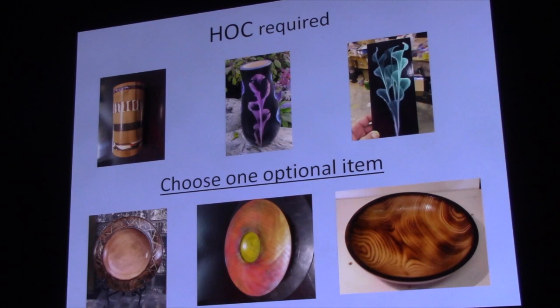And then I thought, well, the first one I did makes way too much, and that stuff's not cheap. It's expensive. So I had some sand, and I tried that as an inlay, and that didn't work at all. So I took the sand on the next one that I was going to do the back of, filled the recess with sand, and took a piece of wood and just scraped off all that excess. Then I took that sand, turned it over into a little bucket, then put it into a cup. That told me how much I needed to fill that recess. So when I mixed my two parts of resin, I only had to mix enough to equal that amount of sand. When I got done pouring, I had just a little bit left over, so I didn't have a lot of waste. That's a good thing.